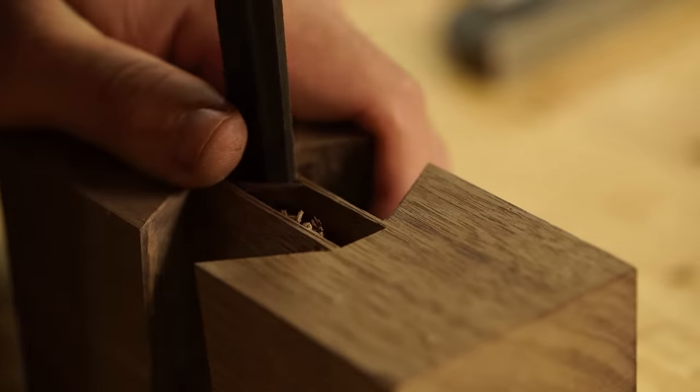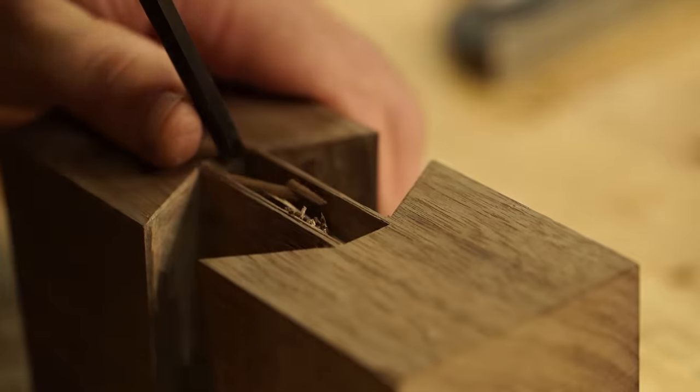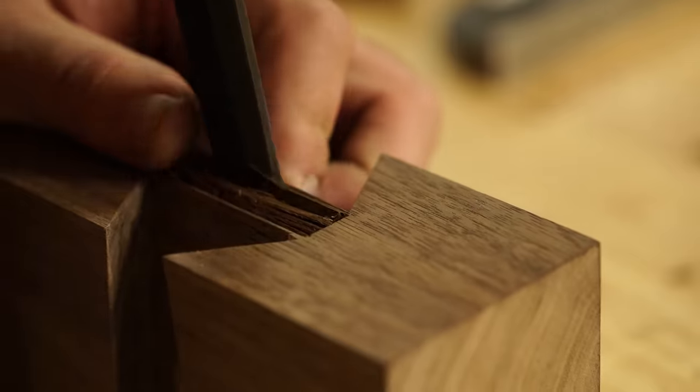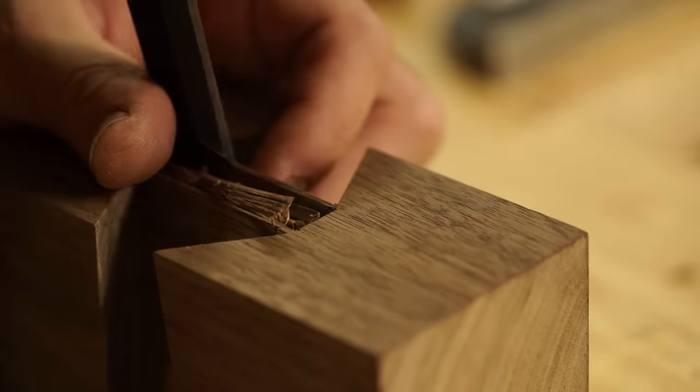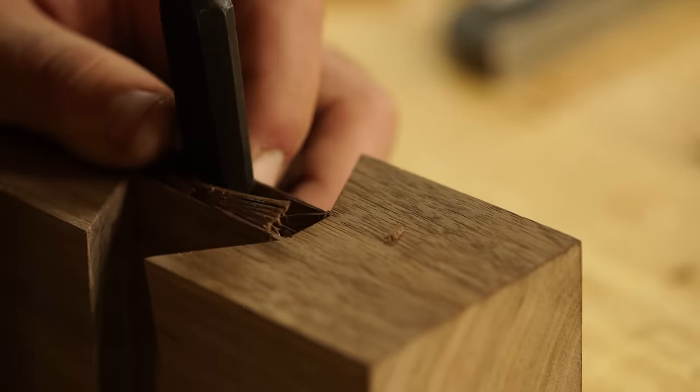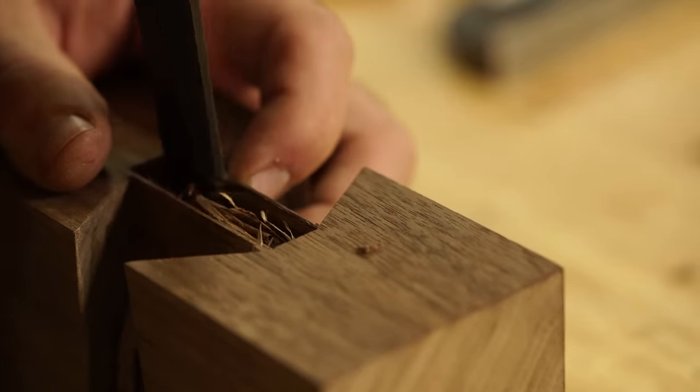You can start to see here on the bottom of the mallet head that the dovetails are not only tapered but are also ramped. They almost touch that central mortise on the bottom. This and how you cut the dovetail tenons on the handle are the key to assembling the mallet. You'll see that later on.